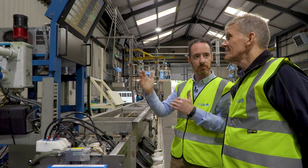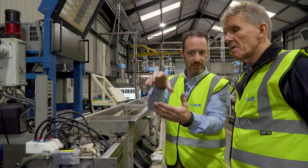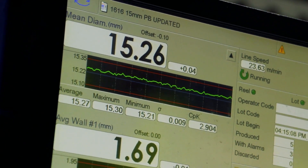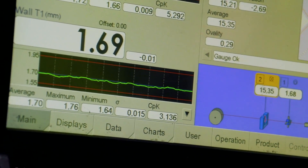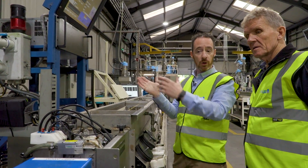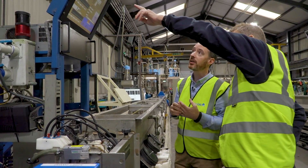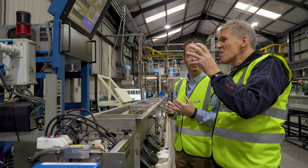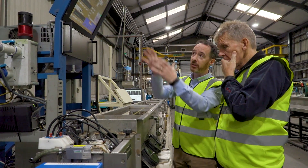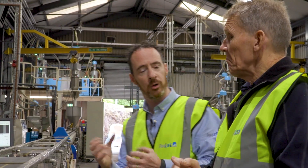So this is the 15mm pipe as we would buy it — reading 15.25 to 15.26mm. There's about a quarter of a millimetre tolerance. At this stage it's still warm, so when it gets onto the drum and coiled up it'll have shrunk down — probably around 0.2mm, maybe 50 microns. You've got to allow for that; historically we know our tolerance range. We cool the pipe as cool as we can through all the cooling baths all the way down — there's 30 to 40 kilometres of pipework involved. That's incredible, 30 to 40 kilometres of pipework start to finish.